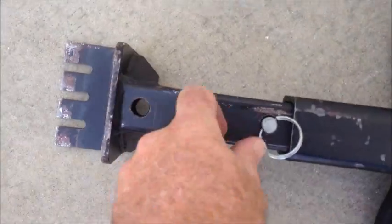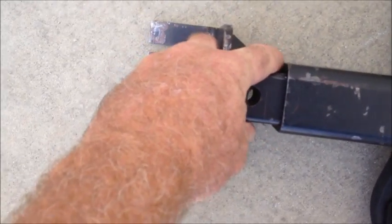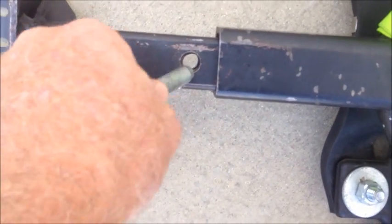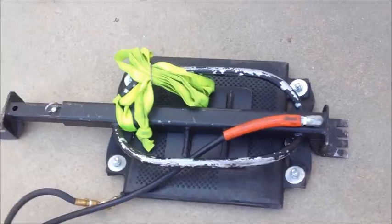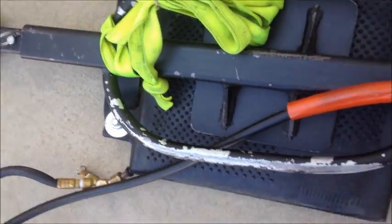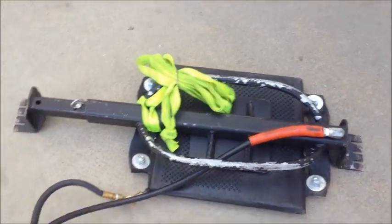The arm is adjustable to accommodate a 32 inch door, preset here for 36 to 42 inch doors. Set the pin there and then it's ready to go. This end is fixed; there's a hydraulic ram here which will push out the arm to lock it in place, and it's a 13 ton lift bag which is affixed to the front.